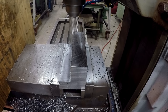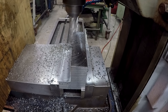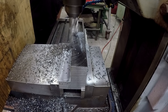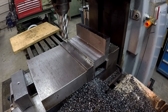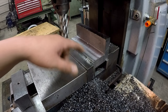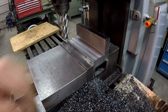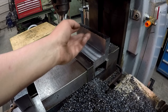This is getting into the third cut here — got a total end feed of two and a quarter, so I'll have another quarter inch to go after this. I still got a quarter inch on the back to take off and a quarter inch on the depth. I'm going to make two passes and bring the bottom down to size. I've already miked it and needed to come up two hundred and forty-five thousandths to bring it to the right thickness. The part's starting to get a little warm, so I'll let it cool after these two cuts.